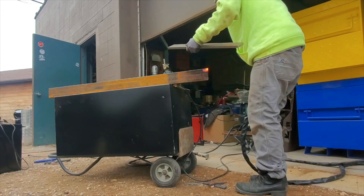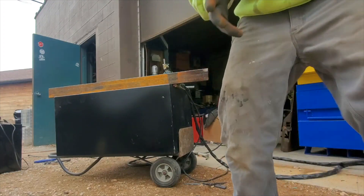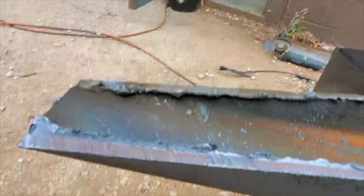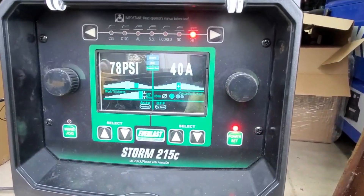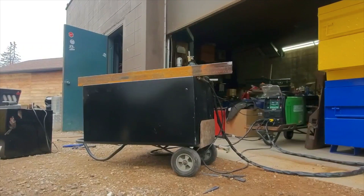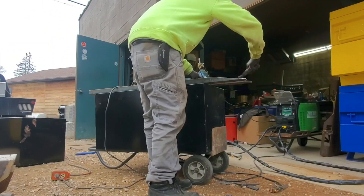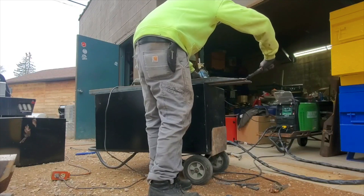There, once fully cut through, the piece falls right on the ground. No bridges, nothing on there. Now, I do have fairly dry air, and we had the pressure set at about 78 psi — maybe it needs to be close to 72. It's a 40 amp cutter. And you can see the cut quality — just the cut quality itself where the metal is cut — it's absolutely great for a hand cutter. There's a little bit of slag there, but one hit with a chipping hammer and it falls right off. I'm not worried about a little bit of dross or slag. There was nothing that really had to be majorly ground off.